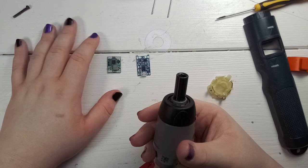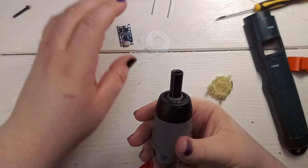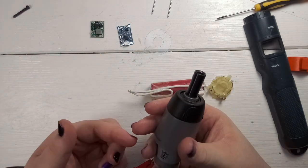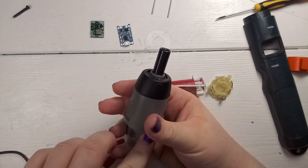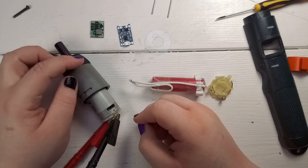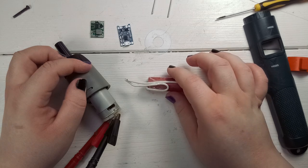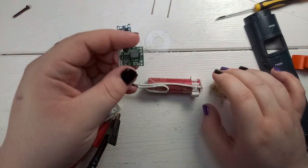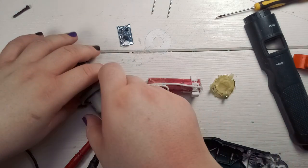None of these modules can deliver 8 amps, not even for a short time. With the 3 amp limit, not even a loose screw can barely be moved. So I bought some BMSs capable of doing up to 8 amps, but I'm still having the problem that I don't have any buck converter to regulate the 4.2 volts down to a voltage this motor can use, and I'm not sure I can apply that voltage directly — I don't want to damage the motor. We are really limited in space.